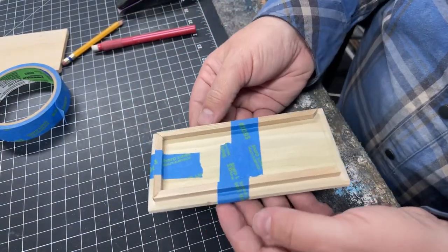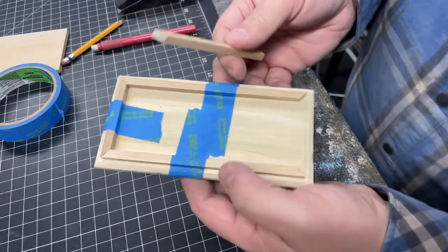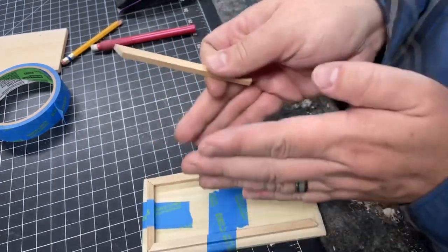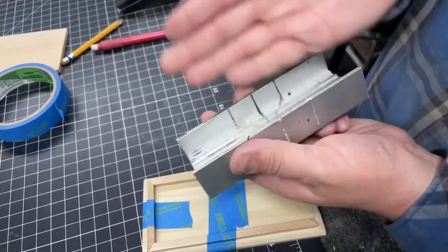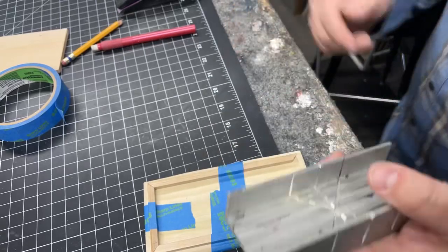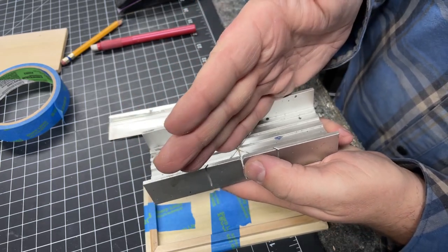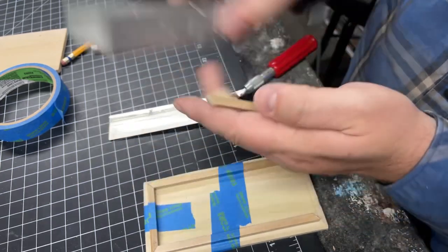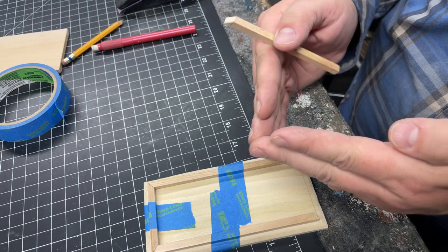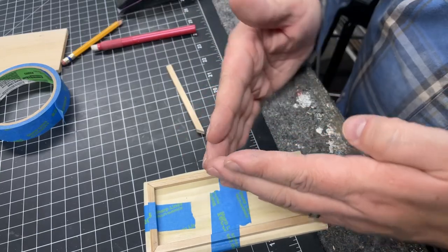Okay, making progress, and we have one more to make. So this is something you can check, and this one I kind of did in a rush, but for those corner fitments to make sure they look nice. Sometimes when you're cutting through your miter box, even though it's nicely angled and set with these preset slots for you, there is play. See that? There's wiggle in there, meaning you can drop your blade, meaning you can accidentally cut at a very slight angle. So it might not be perfectly perpendicular. It might be like 91 degrees or 89 degrees. And that is what causes those corners to be slightly open to one side or slightly far apart. Or maybe your blade curved a little bit when it cut through the wood, so you actually get a slightly curved cut. So it opens up or is too tight at the tip of that corner.